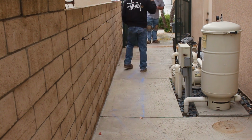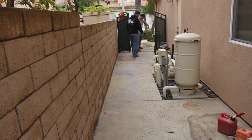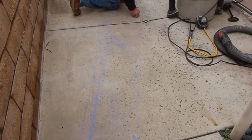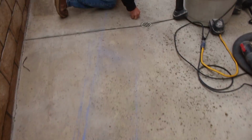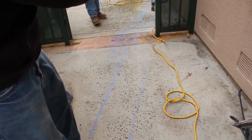So I had to find a spot, and what I did was go closest to the wall, and I knew the footing would probably pop out another foot, so we'll see if it works and if I found a good digging area to get this pipe 18 inches below grade, because of course we're going to get inspections on this through the city throughout this whole process, so we have to go by the book, and it's going to work out real nice.